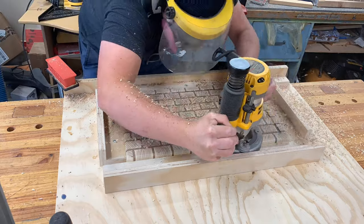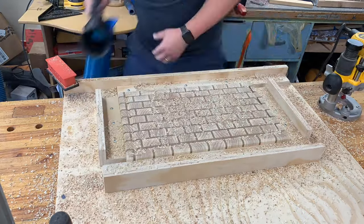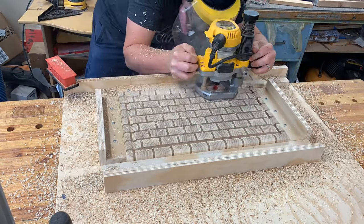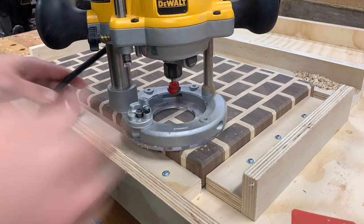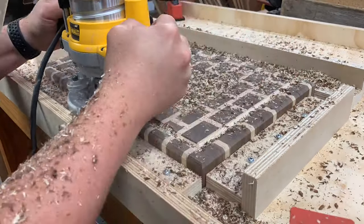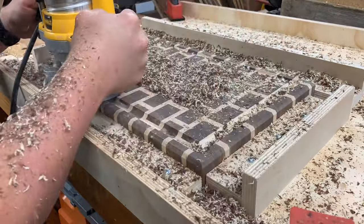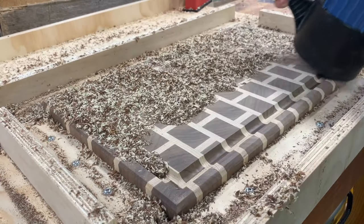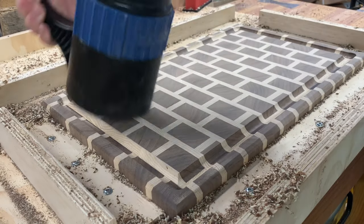For juice grooves I'm using a simple jig with a plunge router and a round-nose bit. I have little two-inch plywood buffers — just plop it down and route out the juice groove. The key is to go really light with incremental depth passes, at a consistent speed. Don't slow down or you'll get burn marks — especially with hard maple. Practice this before doing your special board, but it turns out really nice and is perfect for barbecue and kitchen prep.